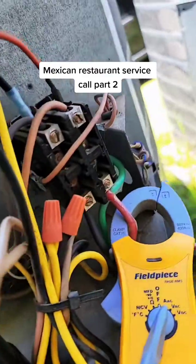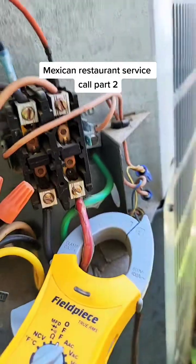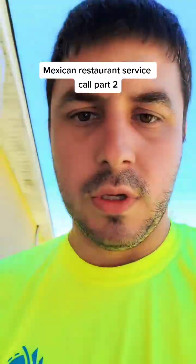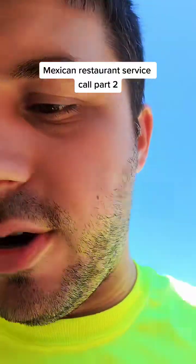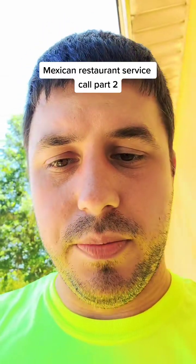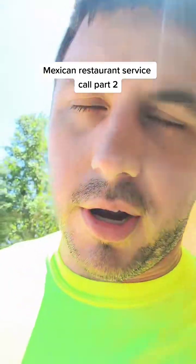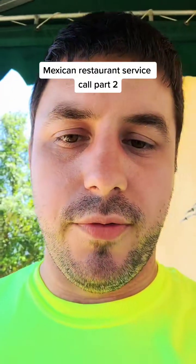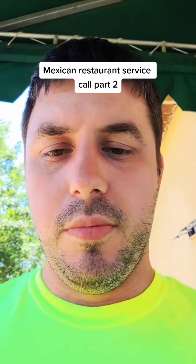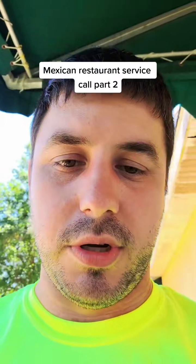The next thing I want to cover is you can see this is a double pole contactor. For those who don't know, you see the two pieces right here in the center — right here and right here. Two things about that contactor: first, it's really safe — if there's no power going to that switch from the thermostat, it won't engage, so the bottom side won't have electricity and neither will the top side. But because of that, it also has a negative aspect. Normally with an electrical motor or any electric component running on 220–240 volts, one side is always going to that component, which typically makes it last longer — but it's just not quite as safe, because if you've got main power going to the unit, there is electricity flowing everywhere in that system, so you have to be very careful working on it.